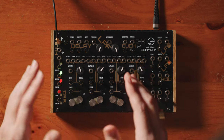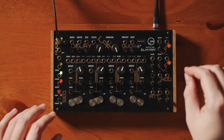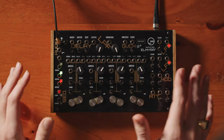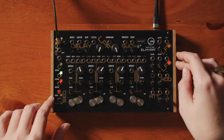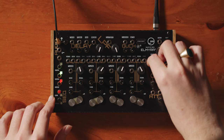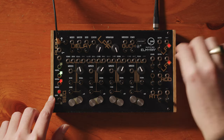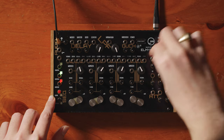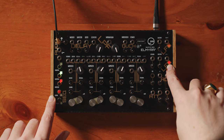This video is getting very long already, so I won't tire you with the demonstration of the LFO or the ADD or ATT ports. They behave exactly as you expect. The LFO1 has only a sine wave as a shape, while the LFO2 has a wider range of shapes that can be conveniently scrolled through via CV or via the knob. And also the LED is pretty convenient to check. Even the shape, we can kind of understand the shape we selected through the LED.